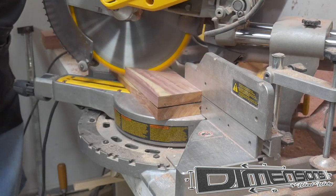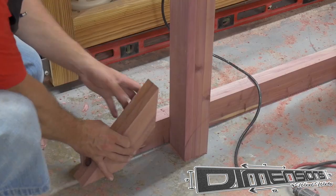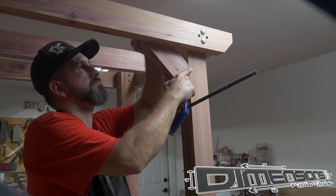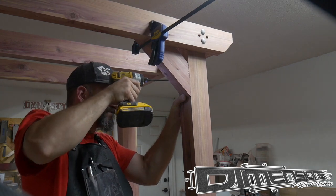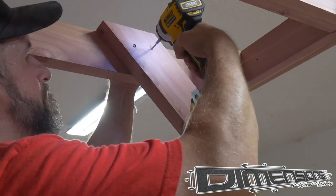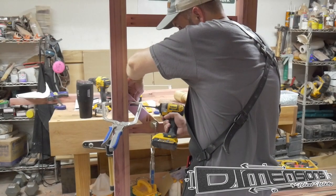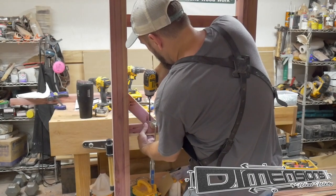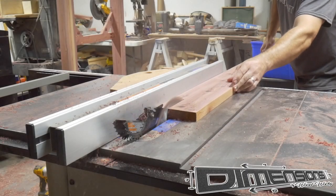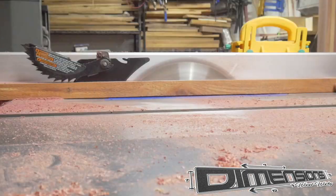A spiral up cut bit in my router made quick work of these two mortises. Now back over at the miter saw, I began to work on these 45 degree braces that go at the top and the bottom, and those really help to prevent racking or swaying in the swing. Then I began to attach these octagonal frames — they're there for a little design element, but they really help to tie the two posts together on each side.